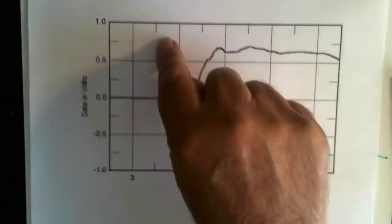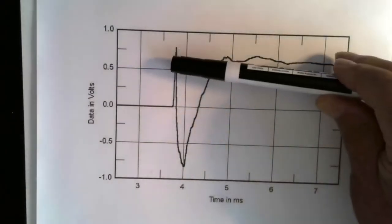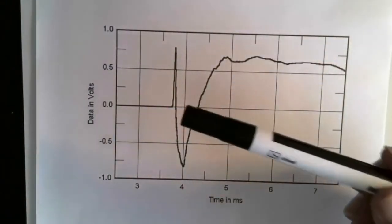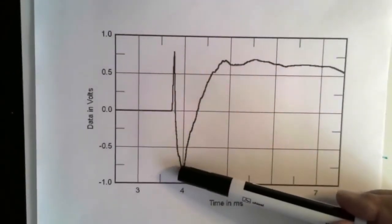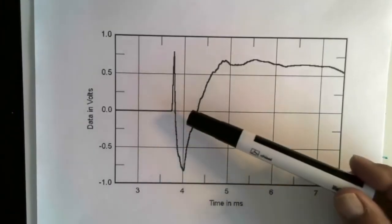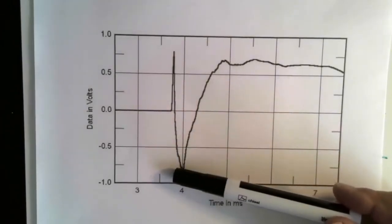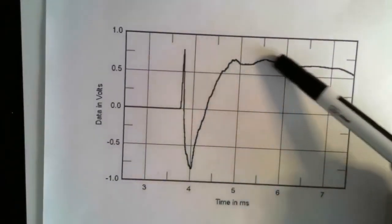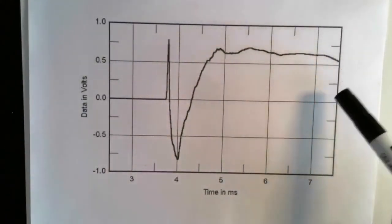Here you can see that the tweeter is in phase. And as I said, because it has a very narrow range, it has a very narrow part of the spike. But now we have the mid-range, which is totally out of phase. And it goes down below the baseline where there wasn't even a signal to reproduce. But because it's wired out of phase, that causes the impulse to go south of the border here, so to speak. And then here you see the woofer is back in phase, so in this case the woofer continues on to the bottom of the line.